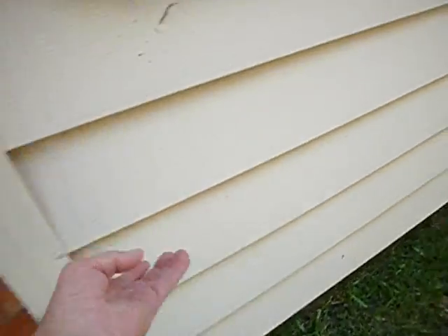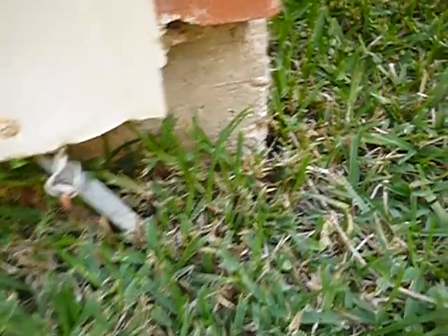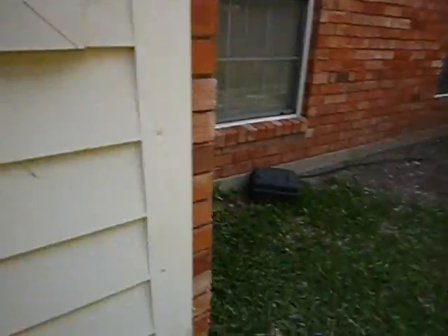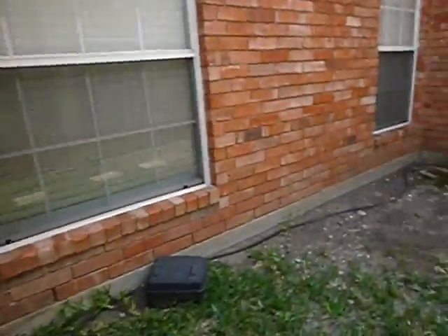This is a cleanout for the master bath. See how this siding is all nice and tight? Vinyl siding is not supposed to be tight like that — it's supposed to move with thermal contractions. You've got a little bit of bent siding right there and a little bit of broken siding right there. When it's installed this stiff, the siding can buckle or even crack with thermal contraction because it wasn't hung properly.